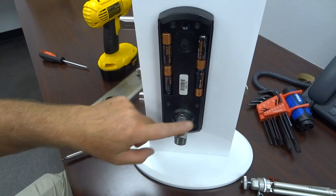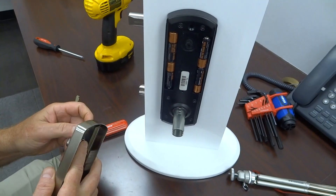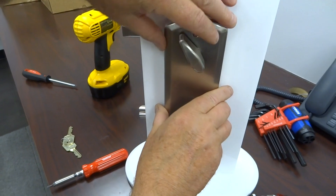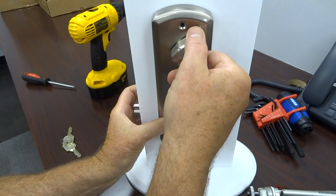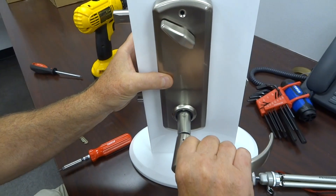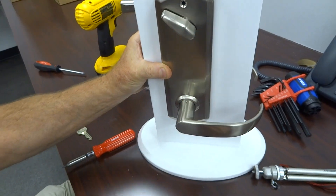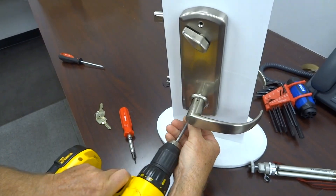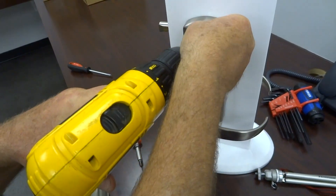We installed our six screws and the battery tray is attached. We can go ahead and put on our inside cover. This only goes one way — you can rotate it and it should extend and retract the dead bolt. At this point we can go ahead and snap on our lever. It should snap on and it won't pull off, and we've got two screws to put in. I'm using power tools, but we don't recommend power tools.